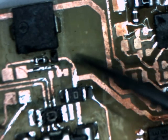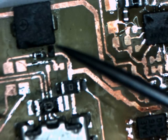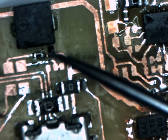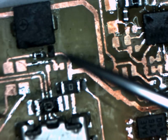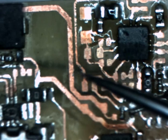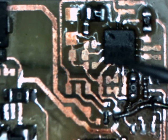I'm also planning to replace, here we have another DFN transistor. I did not realize they made SOT23s in smaller sizes, so I'm probably going to use a SOT-923 or a SOT-723 package to replace these, a very small one, so that'll make the soldering a lot easier. I have to build 3 of these before the 17th for the best product competition on Hackaday, and that'll make getting these finished up a lot easier, getting rid of all those components.